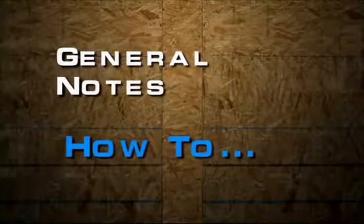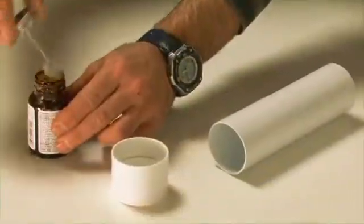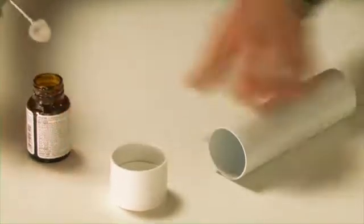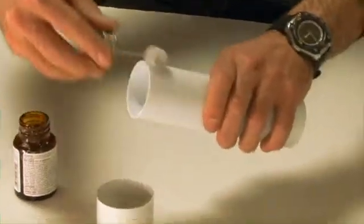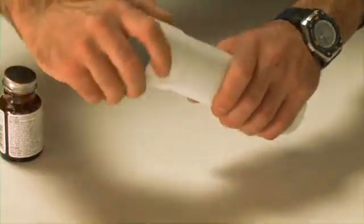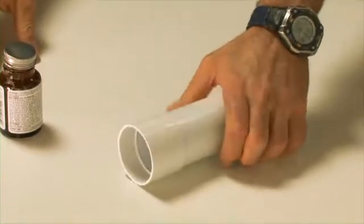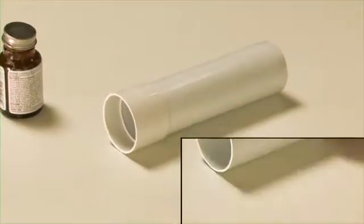To join a PVC pipe section to any junction, elbow, socket, ring, or T, spread PVC cement evenly around the pipe, not in the junction. PVC glue works fast. Do not delay before assembling. Turn the pipe as you insert to avoid air bubbles and ensure a tighter seal. The higher the temperature, the faster the cement bond.